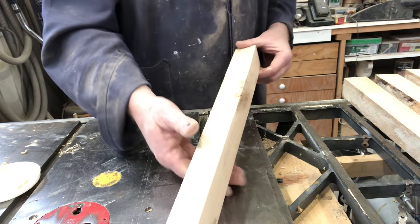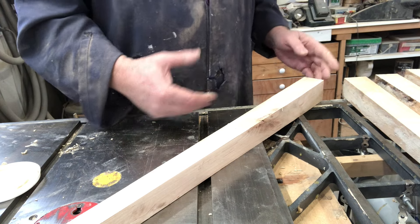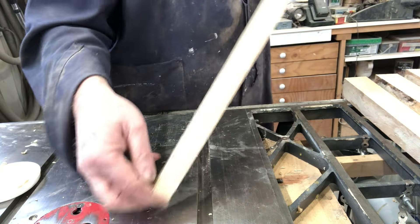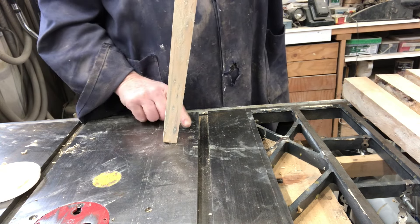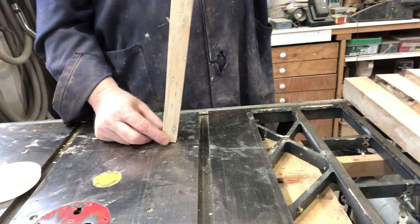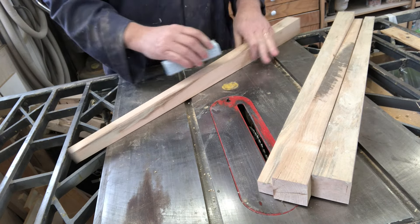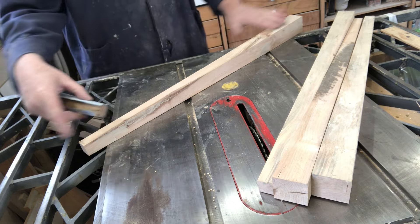But for those of you who appreciate reusing what you can find, thanks for watching. Next bit will be to put tape - well, of course we'll sand and dress these legs a little bit. They're going to cut the legs so they're not going to be standing vertical; they're going to be tilted about 10 degrees. So we'll cut off the bottom and cut off the top, and then we'll build a little piece that will enable us to mount them to the table top itself. Now the filler on the legs has had a chance to set, so I'm just going to give it a rough sand to get it down to the wood.